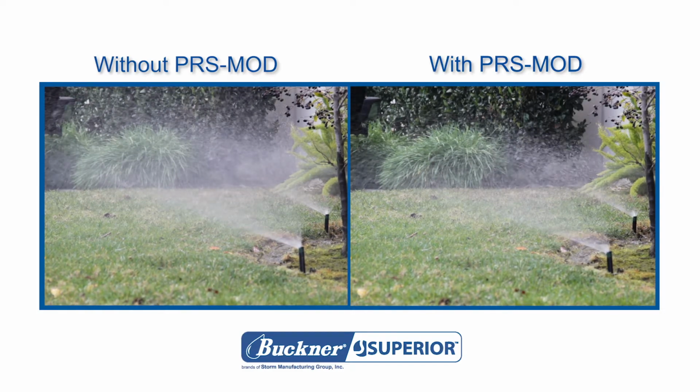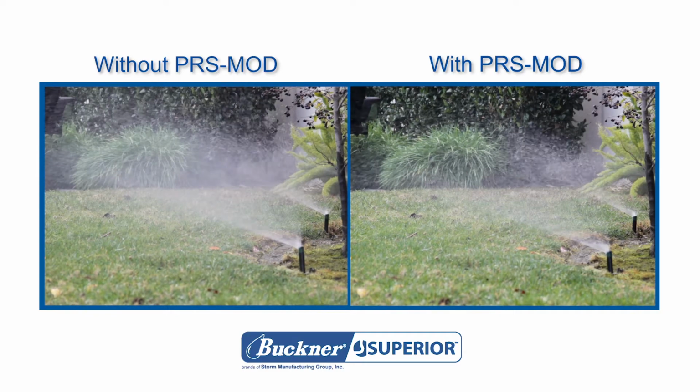This helps with getting a more even spray pattern and helps produce larger water droplets which are less susceptible to wind, thereby reducing misting. Pressure regulation can help achieve significant water savings.